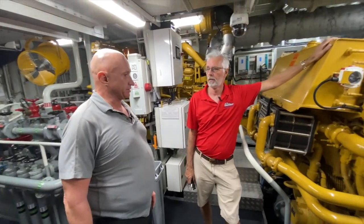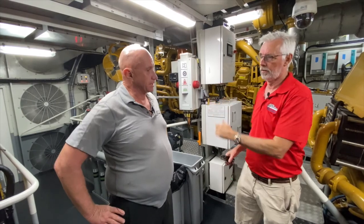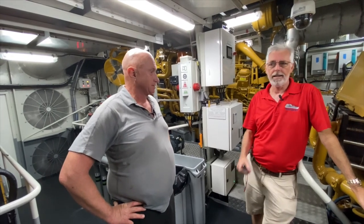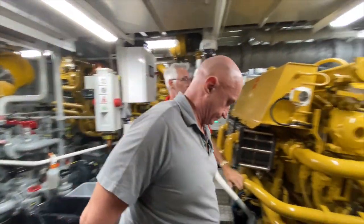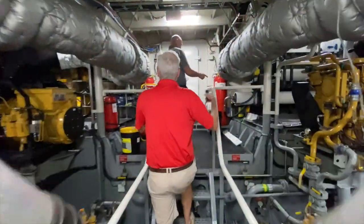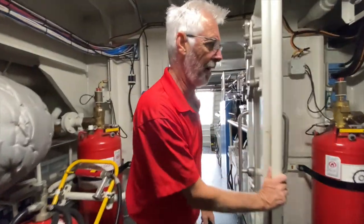Each one of these is how many horsepower? 1,800. Two-to-one reduction. The boat does - you said you can cruise at 20? 20 knots, in anything. Because that bow will just cut through - we don't go over the waves, we go through them. And this boat, you're better going faster. The faster you go, the better the ride. Do you run on just two? Never. You need all four - it's less efficient to run two because of the drag, you have to lock the shafts. And you've got three generators - one here and one in each corner.